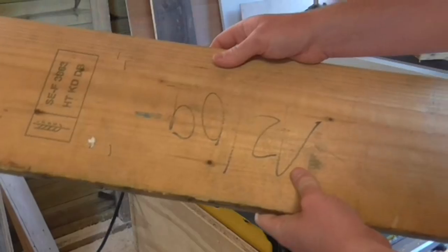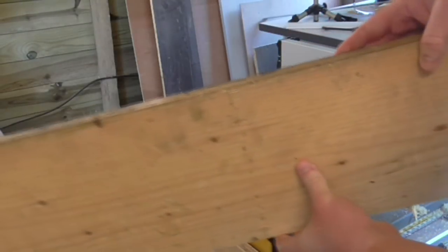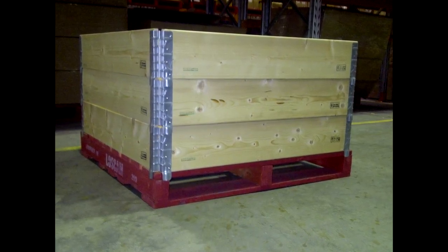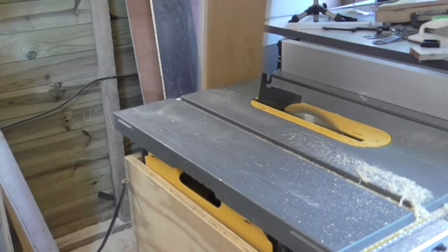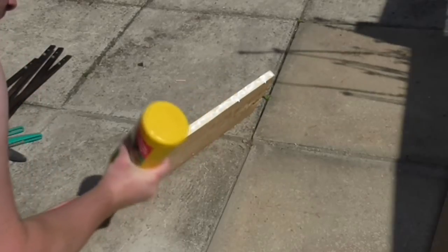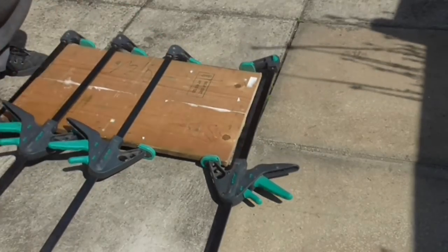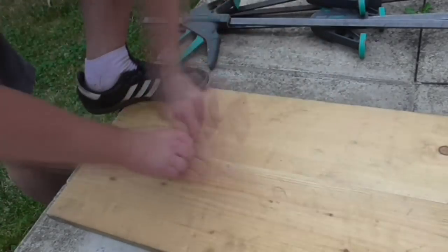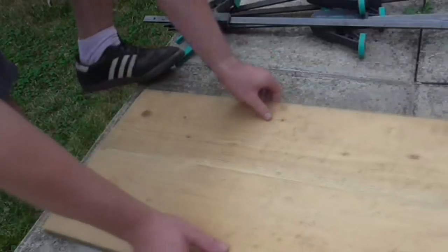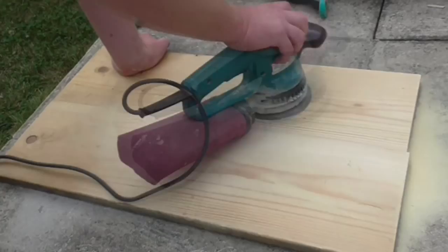Next I wanted to make a roof for the enclosure, which would also be the bottom shelf of the cat tree. I had some wood that a friend donated to me, salvaged from some pallet collars. I squared off one side of the rounded-over edges on the table saw and then glued and clamped the two freshly cut edges together to form a panel. I left this to glue overnight, then removed the clamps, used a cabinet scraper to remove any glue squeeze-out, and sanded down the panels with my orbital sander.